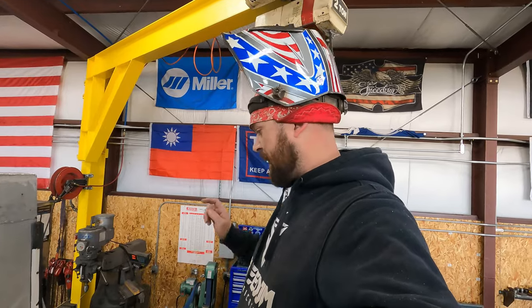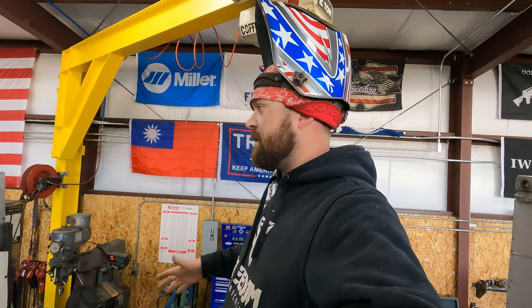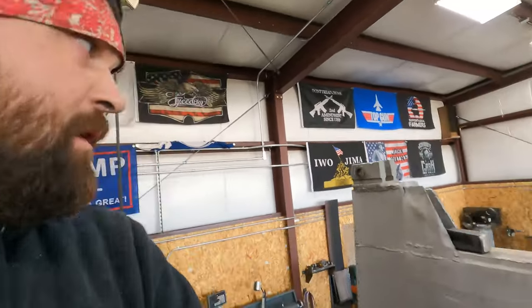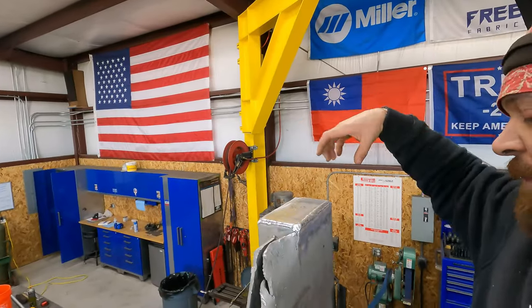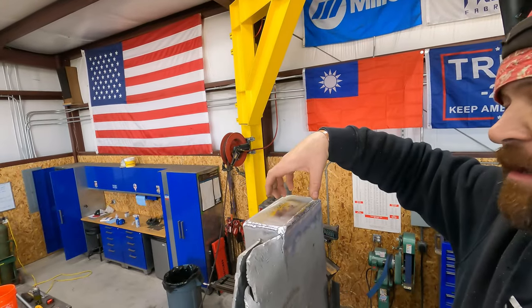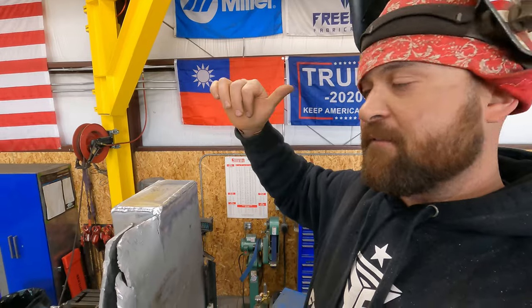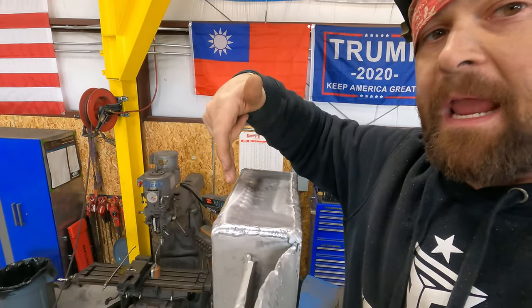All right, so the next step is gonna be to heat up the hinges and bend them back straight. And then I gotta bolt them back to the tailgate and hang the tailgate and see where everything's gonna line up. I'll pin the hinges on the tailgate and then I'll set it on here and see where it hits. I'm hoping that we'll be able to shift it that way far enough that it's not gonna be hanging out this edge. That's the plan. Let's do it.